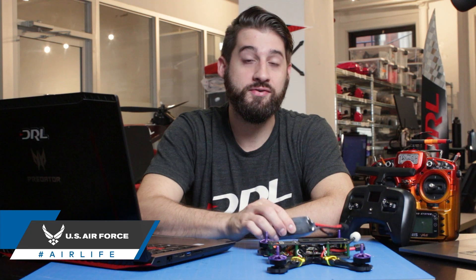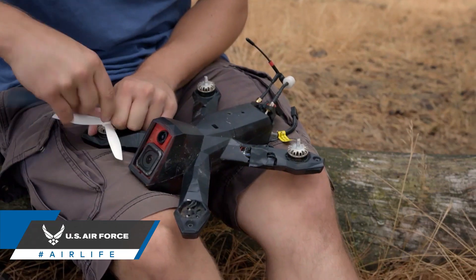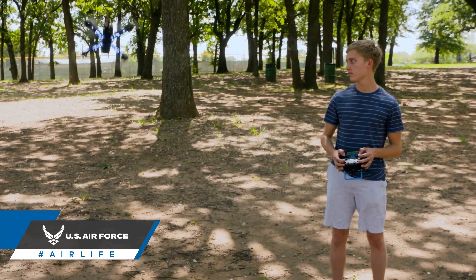You don't want to plug in a LiPo just to have the drone fly up and hit you in the face, or continue to smash your props after a crash. So setting an arming switch is one of the most important custom controls you can set on your transmitter.